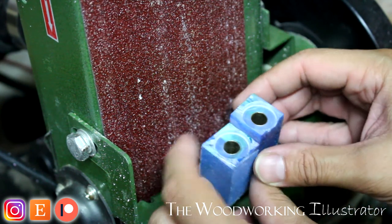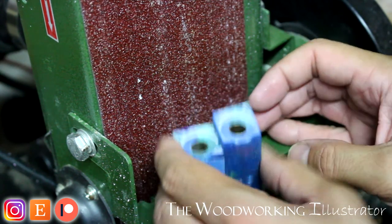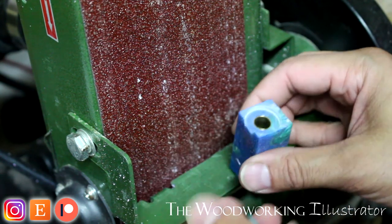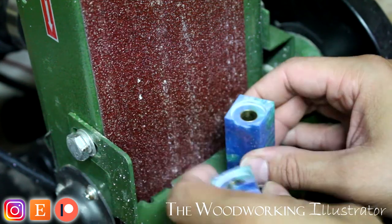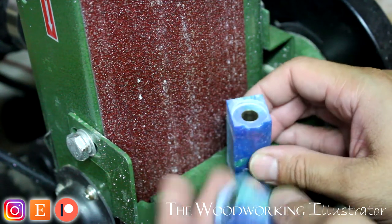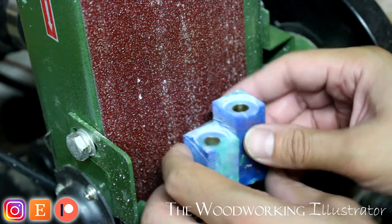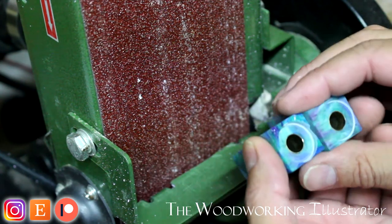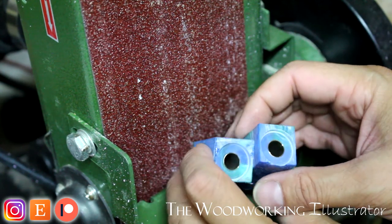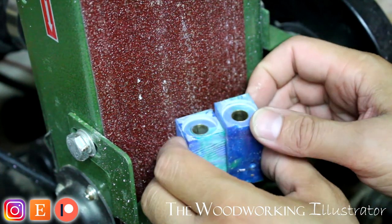And with this material, I find that it's a lot better, and it reduces the chips that may be flying out, or you end up catching your tool and a big chunk coming off or something like that. Because then you can just start and it's already round. It's much easier to work with, especially with acrylester. But it goes even when you're working with wood. If you round it off a little bit before you start turning, you can cut the process a little bit.